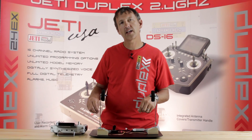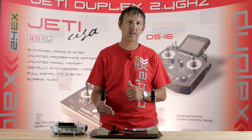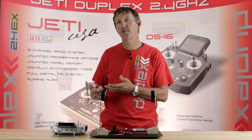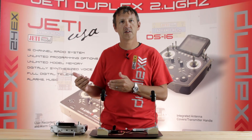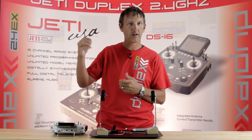What we're doing for our demo today is we're using the MLT sensor to register the altitude. We're using an R9 receiver and a couple of electric retracts. The way we do this is we set up a telemetry control using that MLT's altitude, set an X-over altitude to operate a switch, and we've used 1.2 meters because it's about what I want to reach in front of the camera.